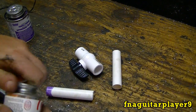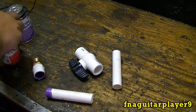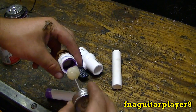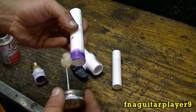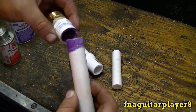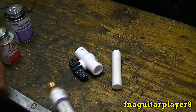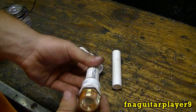You're actually bonding plastic to plastic — you're not really just gluing it. Before it dries completely you can go ahead and start putting the glue in. It don't take much glue at all, especially for something like this that ain't going to be used all the time. Put a little glue in there like that, slide it in, kind of twist and turn it about like that and it's ready to go. Let it dry by the instructions on the can, however long it's supposed to, and you're good to go.